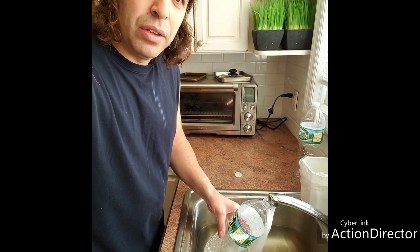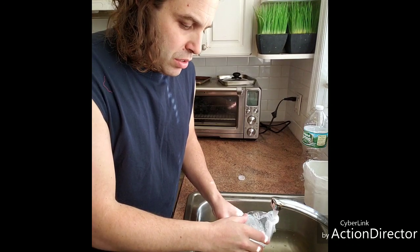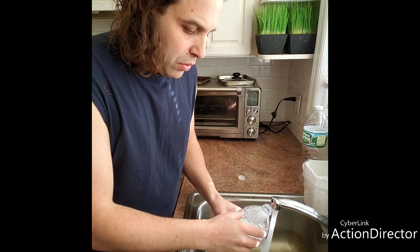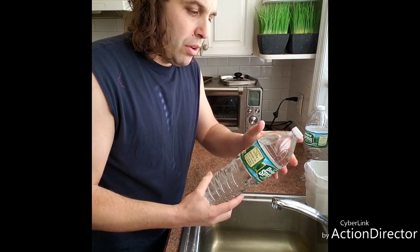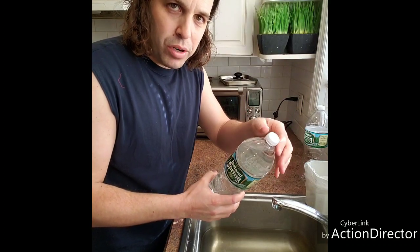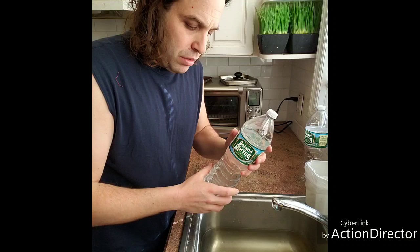But if you want to try this simple step first, you might not need to lug that equipment upstairs or wherever. What I do is just take a plastic bottle and fill it up. I actually have a tool called a kinetic water hammer that shoots water down the drain, but I just came up with this idea and it does the same exact thing. That piece of equipment is almost a thousand dollars, so this bottle here will give you almost the same effect. You can use this kind of bottle, or one with a wider mouth works good for a bathtub or bathroom sink, but this will work great for a kitchen sink drain.